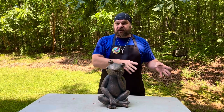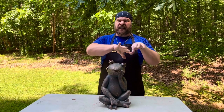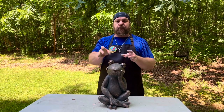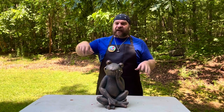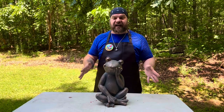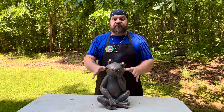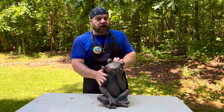Here's what we found out after a good year, year and a half — maybe two years out there: every single statue had damage to it except for the ones that had no type of sealer — the one that was just paint, and the one that was completely raw with no paint, no sealer. We found that some sealers caused the concrete to completely crumble, others turned it yellow and made a nasty discolored shell, and others had premature pitting and aging. What we determined was that those big expensive cans of sealer meant for patios and driveways did not work well for statuary.